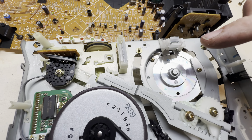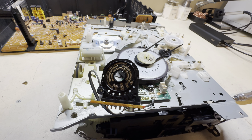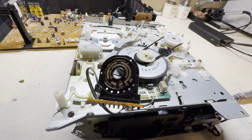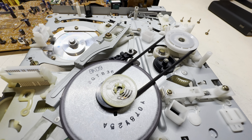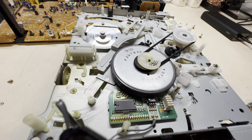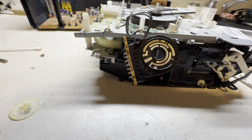Once you remove the front panel, these are actually pretty easy to service. The mode switch doesn't require removing the whole PCB. All you have to remove are five screws — one there, one there, one there, one there, and one over there — plus the shield. Once you do that you just grab the mechanism and it literally lifts right out. This was a much better quality deck, and there's an interesting component I haven't seen on these before.